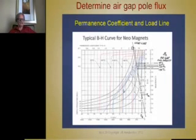But the demag of these materials doesn't show up at 20 degrees C. It doesn't show up in the second quadrant. The knee of the curve does show up in this quadrant at higher temperatures, but it doesn't show up at 20 degrees C. So the data in the third quadrant is converted to be plotted and displayed in the second quadrant so I can use it there. That's a new plot of the sum of the BH values for every point on these curves, plotted up here. So I've converted the third quadrant BH curve into the second quadrant so I can analyze it for demagnetization. And we'll look at how you do that later. I think we already went over that in the magnet section.